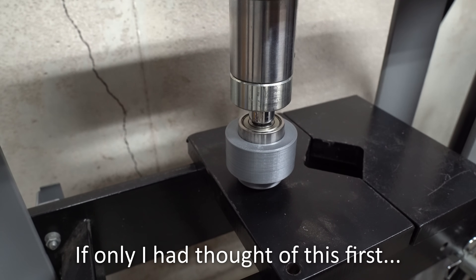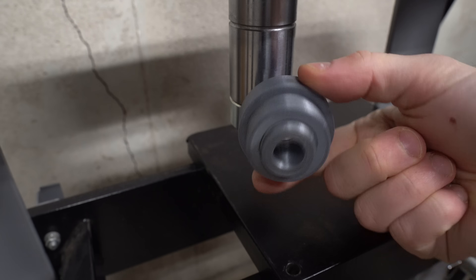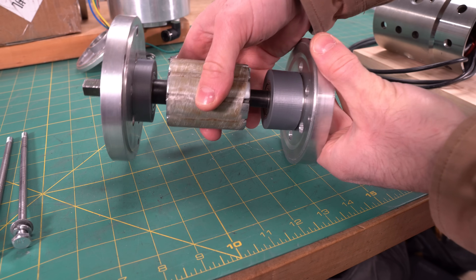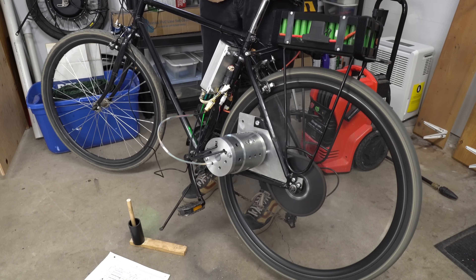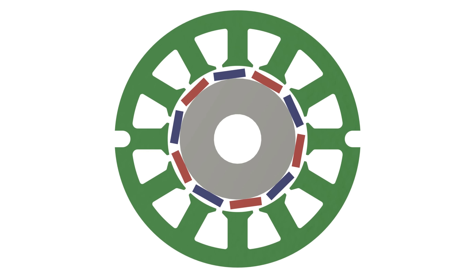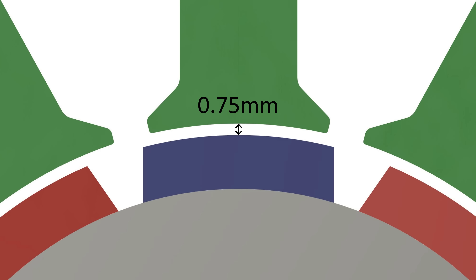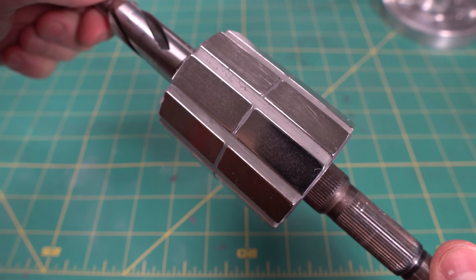This time the motor was extremely powerful and had no problem moving the bike. I think the main problem is that I used block magnets rather than arc magnets, which resulted in a larger air gap. The air gap of a motor is the gap between the stator teeth and the rotor magnets. With my homemade rotor, the air gap ranges from 0.87mm to 1.6mm, while the rotor from the brushless DC motor has a constant air gap of 0.75mm. Additionally, I have no idea what grade the magnets on the brushless DC motor are — they could possibly be a stronger grade than the N42 block magnets.